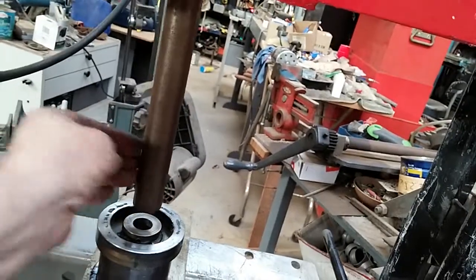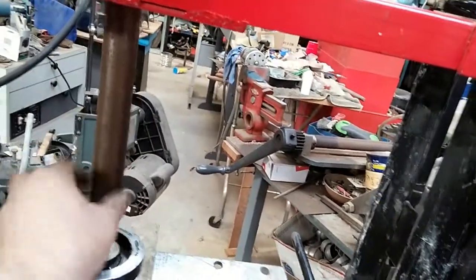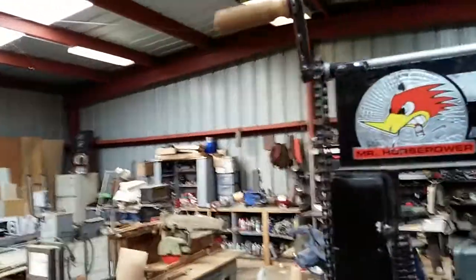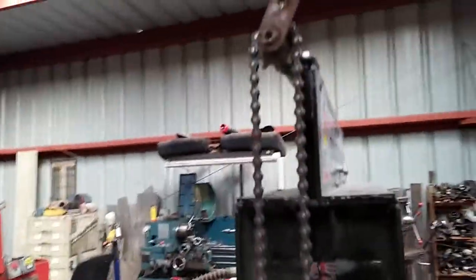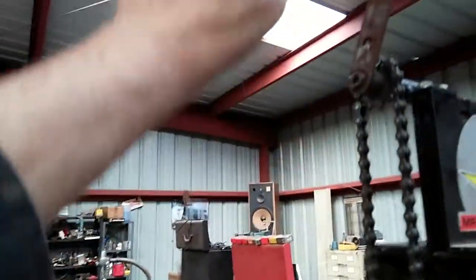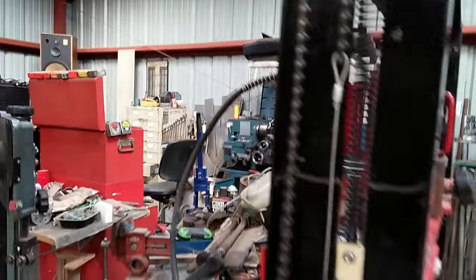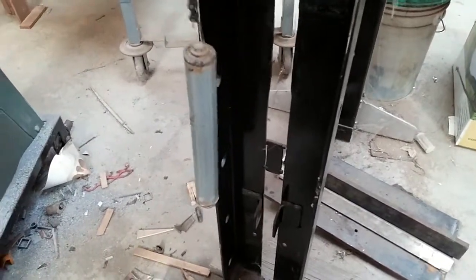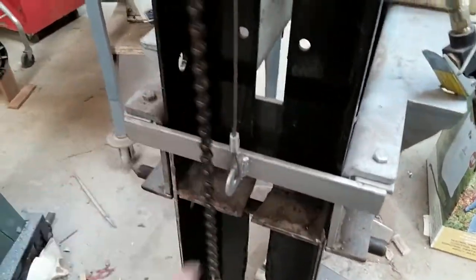This is really rigid now. I think I'm going to cut this down though, because it's so long. I also put a crank-up table on it now. This is a chain from a garage door opener I had, and a sprocket. I only had one sprocket, so I made a handle for it. It's got a counterweight at the bottom to keep tension on the chain, and then there's a cable here — I used a piece of cable because I didn't have enough chain to go all the way down.